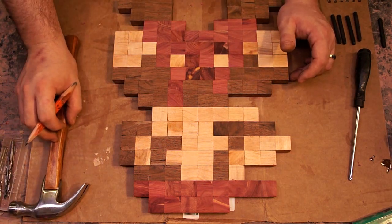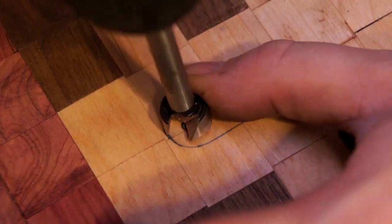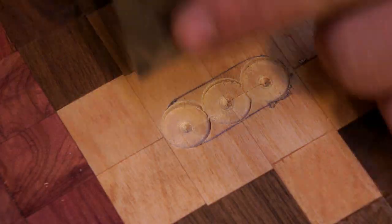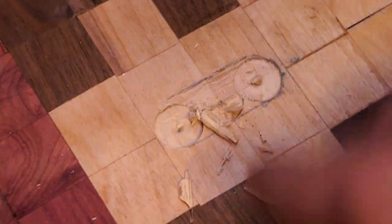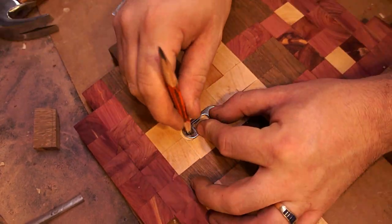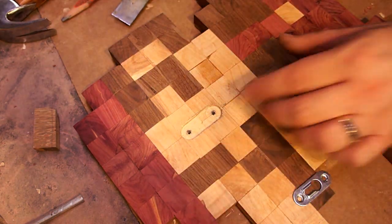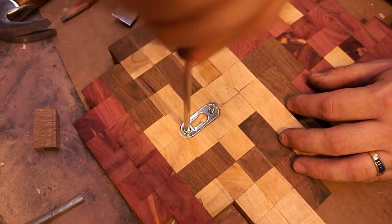Here I'm figuring out exactly where and how I'm going to mount the hanger — this is intended to go up on the wall eventually. I didn't want it to sit proud of the wall, so I got these Forstner bits and got the majority of the material out — just the thickness of the little metal bracket. Then you can see me coming back through with a chisel, getting the whole thing recessed back in enough so it's not going to hang out far from the wall. This next step is one I always skimp on — it takes about two seconds but it is pre-drilling. When you don't do this, I always end up splitting the wood or stripping the screw head off before I can drill the holes.